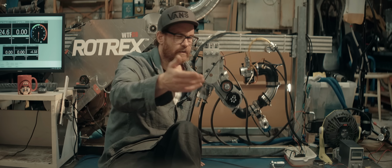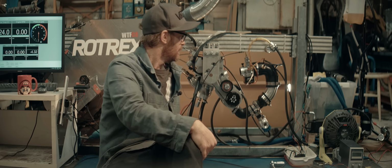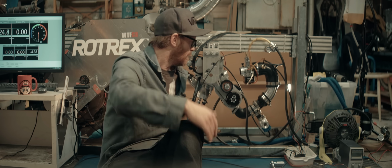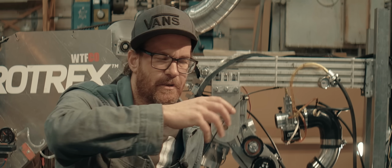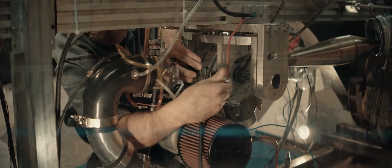And also I have very little experience with hearing if a two-stroke engine is running rich or lean at idle and low RPM, when it's almost been dragged down by load from, in this case, the supercharger. It's just never the case. Usually you don't set idle and adjust carb for low RPM under heavy load.